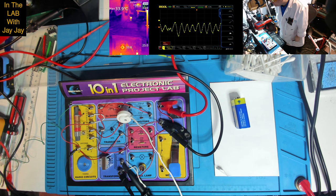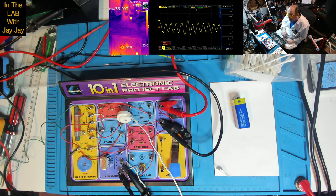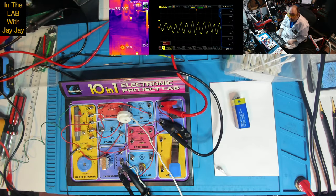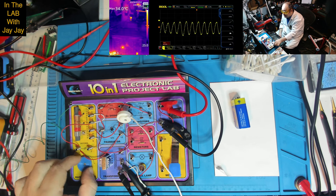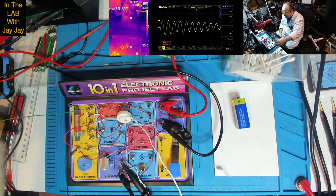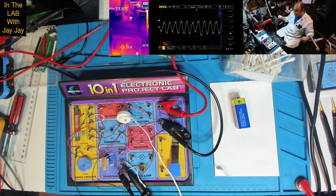Yeah, not as much as the transistor. So we've noticed the NPN transistor get hot. Over here, we can see that it's drawing 5 milliamps, which is 0.005 amps. So that's 5 milliamps currently being consumed from this circuit at 9 volts, or 8.98 volts. And the tuning capacitor doesn't even seem to affect the output sound, so I'm not sure what to tell you about that. We've used the long aerial. Moving the aerial around doesn't seem to have any effect on the sound at all.